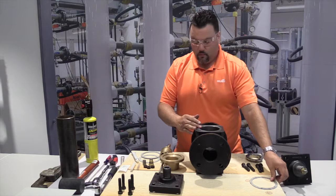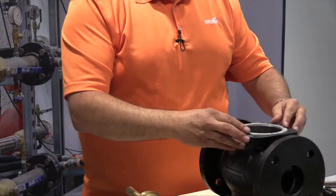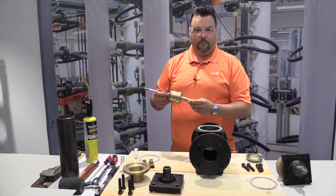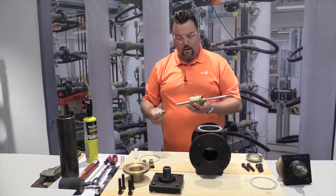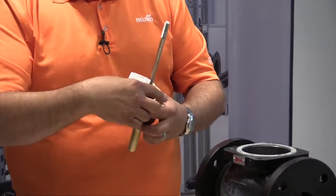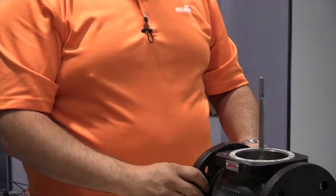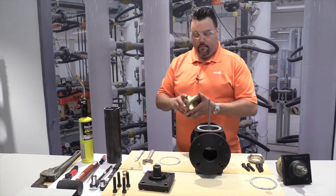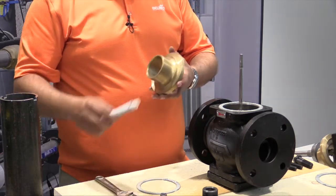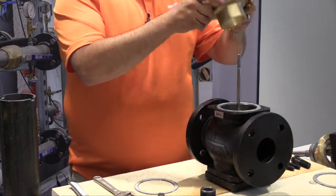From here we're going to put our new gasket material — again, some of the sealant — and put the gasket material down. From here we have to put the plug in. We take some of the grease and apply it to three spots on the plug: the shaft, the O-ring all the way around, and also on the valve stem. That'll go down into the pilot hole in the bottom of the valve. As the next step, take your chamber, apply a thin layer of gasket sealant, and also a little bit of lubricant inside the chamber, and put that down.